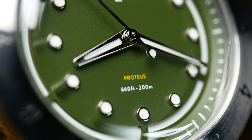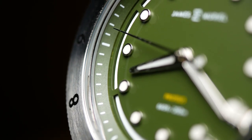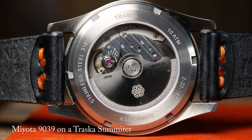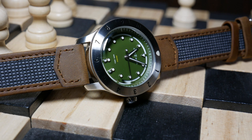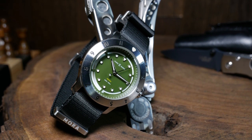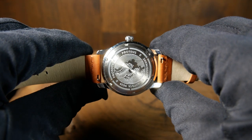It's worth noting that with this design they are kind of at a disadvantage — just with those small indices and narrow hands, you only have so much surface area to go around. But they do have that sunken lume area, and I think that's something they should really capitalize on by going as crazy with it as they can. As for the movement, we have the Miyota 9039, which is basically a non-date, slightly thinner Miyota 9015. Personally, I do like Miyota 9000 series movements — they're high beat and have hacking and hand winding, as well as about a 42-hour power reserve, so they're pretty much everything you want, and decently priced compared to Sellita and ETA movements. However, like the 8000 series movements, they're not bidirectional when it comes to winding, and they may be a little bit louder than you're used to. The rotor noise does bother some, but personally it never bothered me at all — I never even really notice it unless I'm holding it up to my ear.